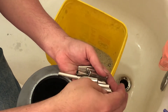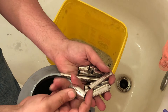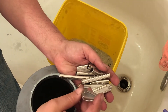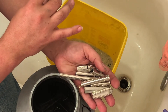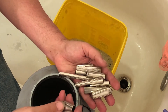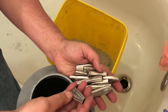From this point, if you wanted, you could take and use another polishing or buffing compound. If you wanted this shinier, what I would do — now that all that dirty water and filings and everything are out — is run this again just with the Dawn and the media for about half an hour to an hour, depending on what you like, to get a little bit better shine.